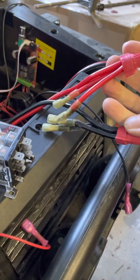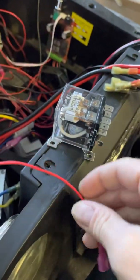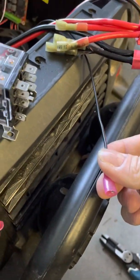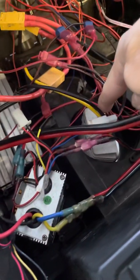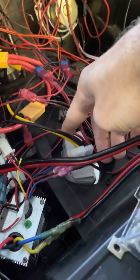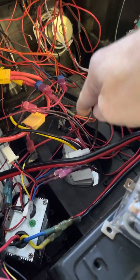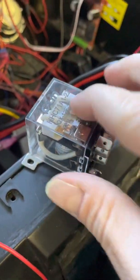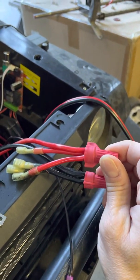This is 12-gauge wire. I've got two LiPos in here, so I've got to be super careful about how I handle these amps. This is my switch wire that I've connected, and this is just simple 12 volts. This is a 24-volt — well, now it's 30-volt — ESC, connected to a regulator that steps it down to 12 volts. I have my switch connected after the voltage regulator so that it can be controlled by a 12-volt switch, but these wires have 32 volts and like 30 or 40 amps going through them.